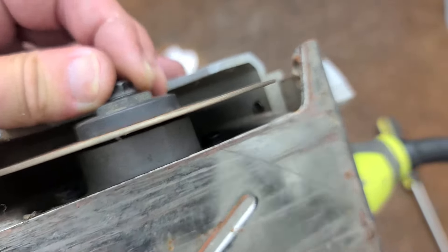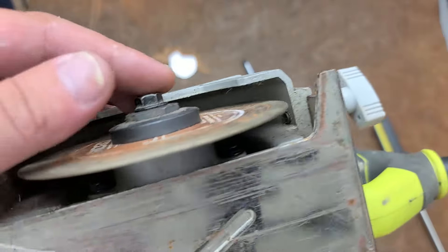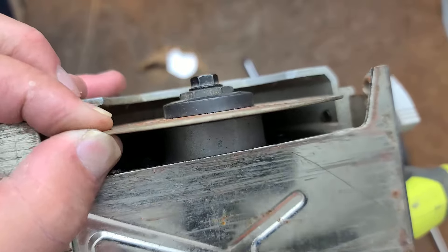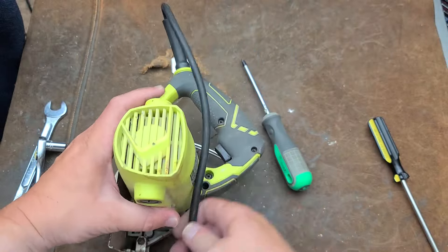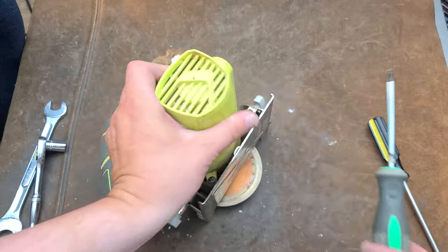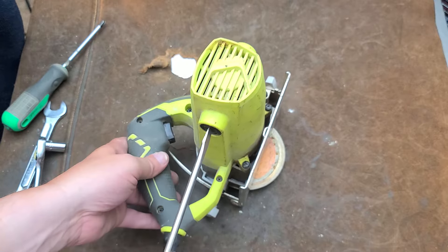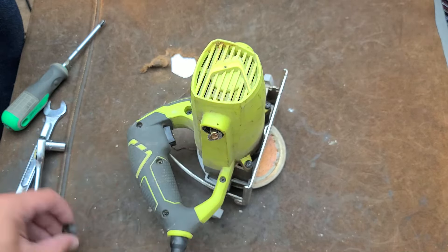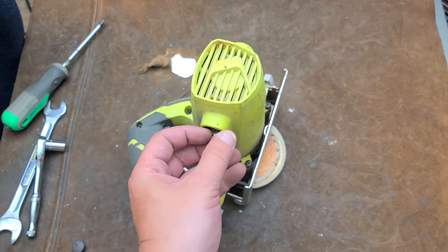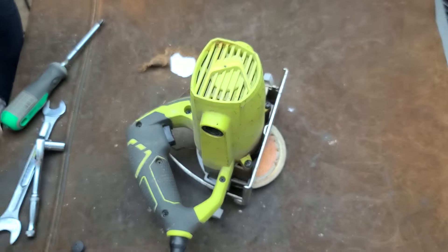Got that back together — that's all they needed. I don't know why they didn't put that in from the factory. Probably because they just determined it was unnecessary. But it sure is nice to do something like this, and now this saw has just a perfectly tight spindle but still turns really easily. We'll take a quick look at this motor since 12 amps is big for a Ryobi. They're not going to have very many tools besides some of their miter saws with motors like this, which is surprising — it really is pretty high performance. We can see that the brushes are still pretty long. Yeah, it's pretty high performance — kind of weird.